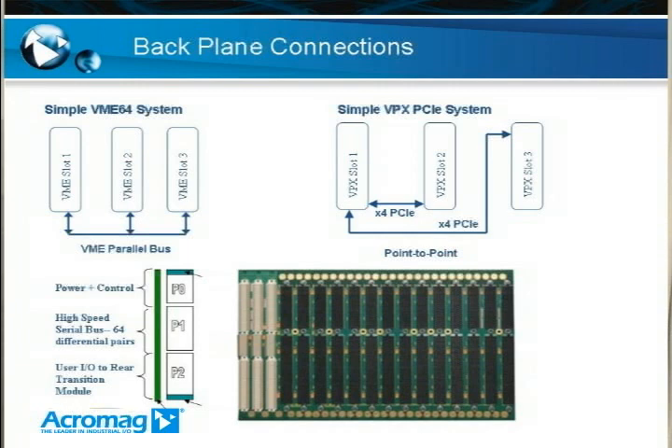The three examples I gave are relatively straightforward. However, VPX backplanes themselves can get awfully complicated. On your screen you can see an example of a fifteen-slot VPX backplane. Imagine how complicated the routing can get from slot to slot when you have to do point-to-point connections. The big question is how do you do it? The VITA 46 base standard has a couple of recommendations but is rather silent on that, and we'll come back to that in a bit.